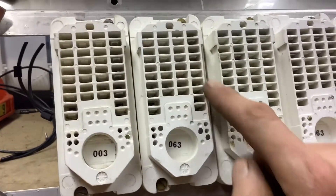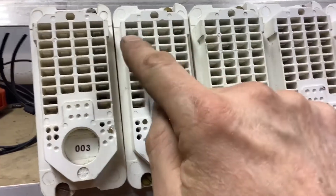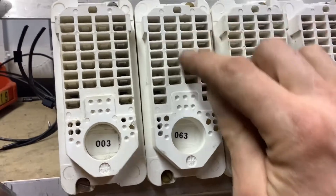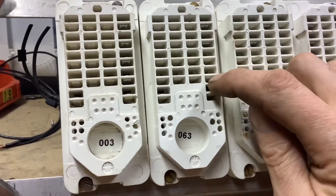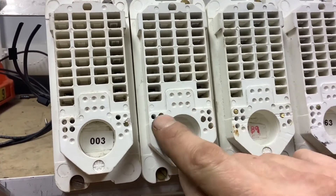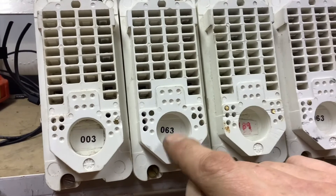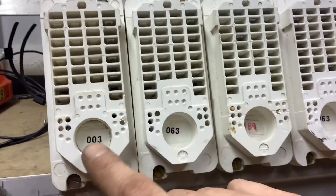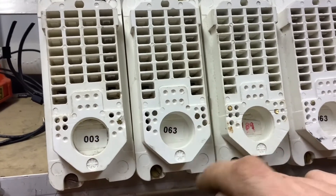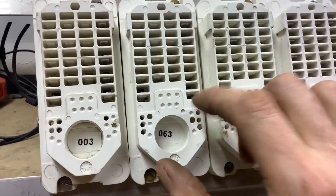Now, looking at the 930 plug base from the relay side — where all your contacts go in — we're backwards here, so this would be row A, row B, row C, row D, contacts 1 to 8, and then you have your coils R1, R2, R3, R4. You have your pin code — this relay here would be an 063 pin code and this is the 003 pin code — and you can see the holes drilled are different, about a 3.5 to 4mm hole, which is part of the pin code.